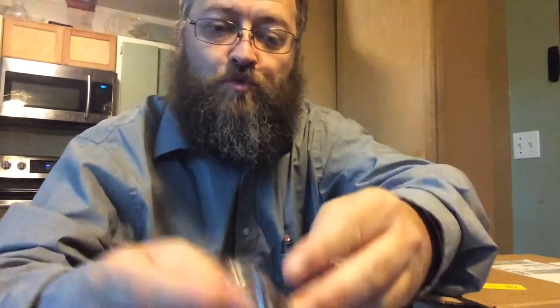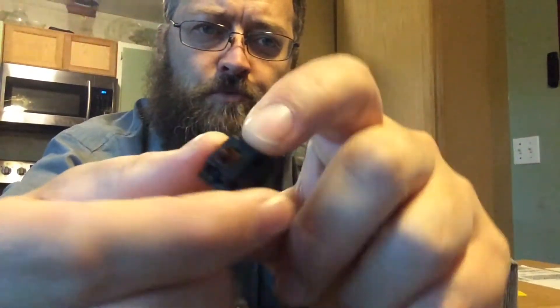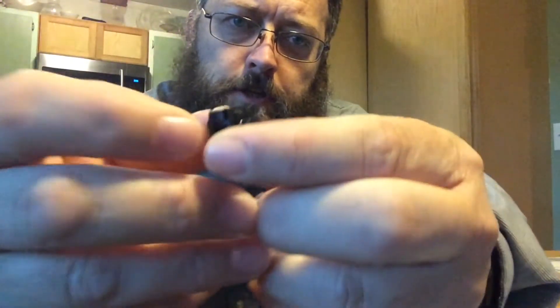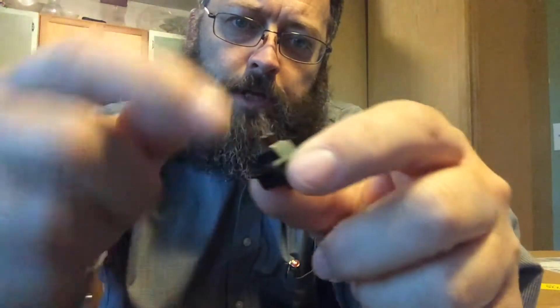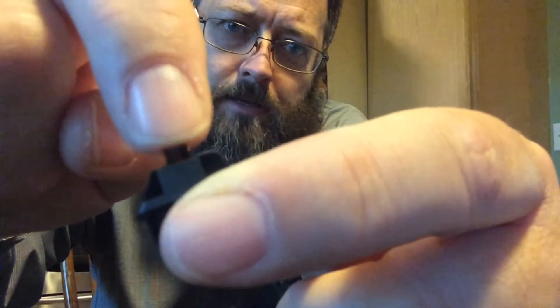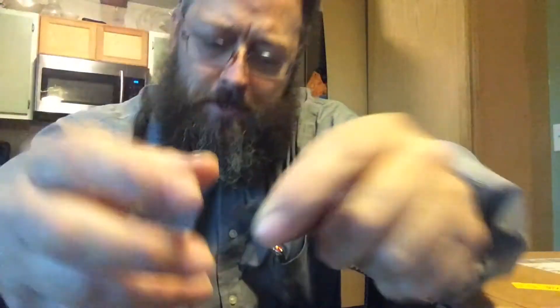These are the switches — you know, those things you push down on? These are called Cherry Browns. This is a Cherry MX Brown switch. So when you click on your keyboard, you're actuating a switch that lets electricity flow through there. It lets a microcontroller know what key you pressed. The Cherry MX Brown has some tactile feedback to it. Right about there, there's a little click — so I know that I've actuated it. I can feel it in my finger.